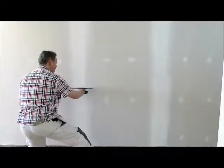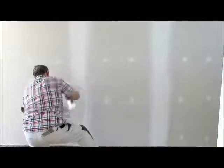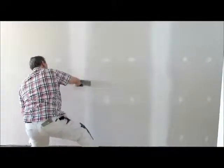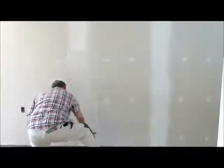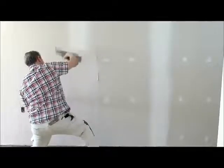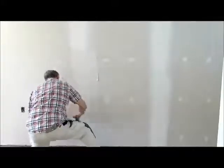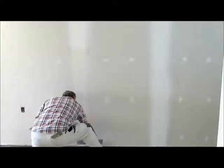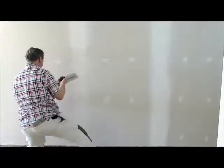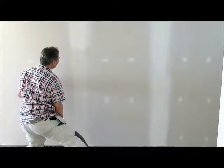With the 16-inch, the idea is to try and go a little bit wider on both sides. So with the 16 I kind of give it two rows, and then same as the first coat — ream it up the side, up the other side, and then kind of vee it towards the center. That seam is about 18 to 20 inches wide.